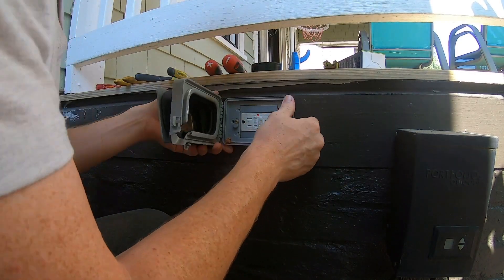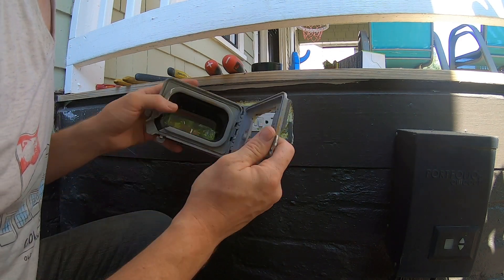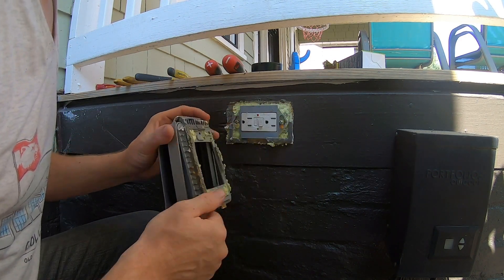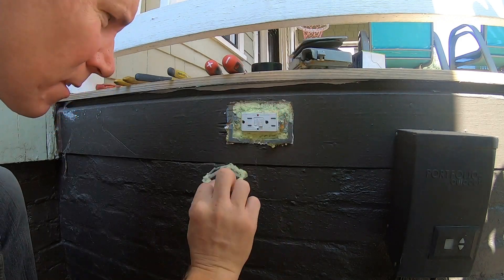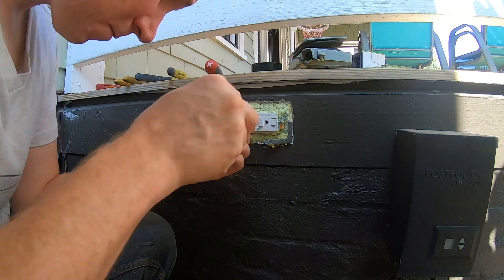I'm doing this with a pen tester as a quick and easy test, but one word of caution: if you want to get technical about it, the best way to truly test for any electrical current is to use a multimeter. If you are unsure or unfamiliar with your house's electrical, I would go this route.